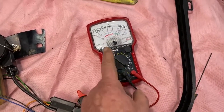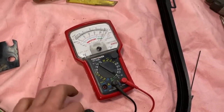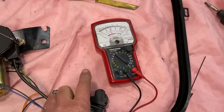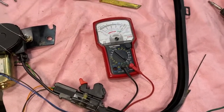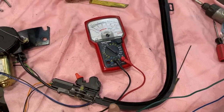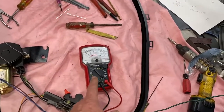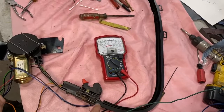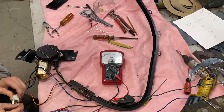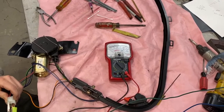You can hear the audible and you can see the needle move across. Now when the bar is put into the trolley, as you can see, that micro switch activates correctly. Without the bar in it, we're going to go ahead and activate the trolley mechanism and see it go up. Notice that there's no continuity, but there will be continuity as soon as the trolley leaves. And now you can hear that the micro switch has been released there, which is correct.